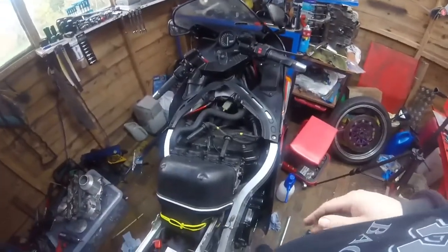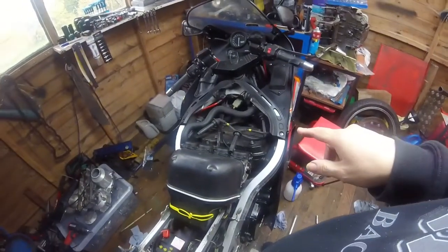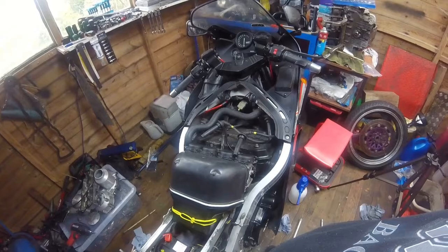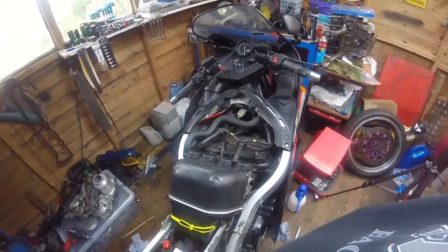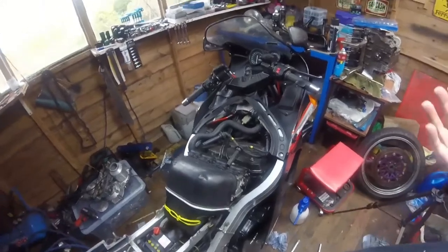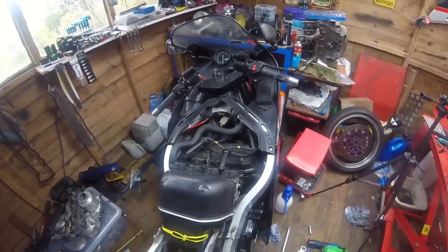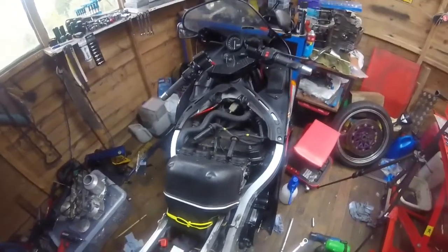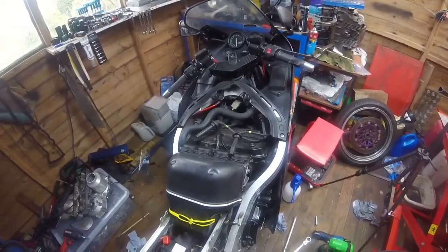I serviced that in an earlier video as well. Yes. You're very talented. And then I'll just blow all the crap out. And then I'm going to test for spark on one of the leads, because I've got a really weak spark out of the other spark plugs, which obviously is not going to help. And just see if we've got a nice biffy and robust spark from the new plugs. So I'll get set up and I'll do that.